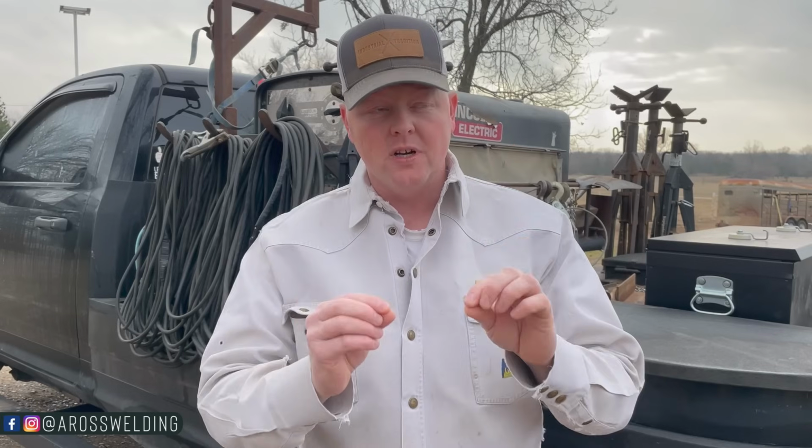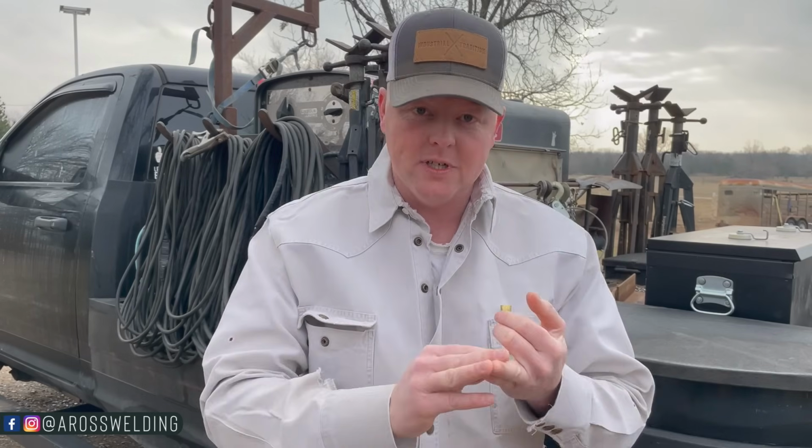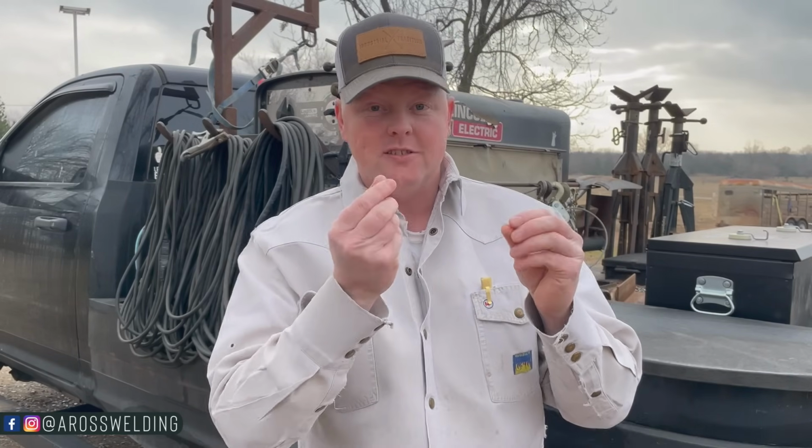But I got as far as like the 6-inch branch, but on the 2-inch welds and the 8-inch welds, they just x-rayed those. I don't believe they pulled straps, if I remember right. And everything with my 2-inch and my 8-inch was good, except for one of my 2-inch had some porosity in the start on the bottom. So that's where I remember getting some weld shot. I couldn't remember for the life of me whenever I was making this weld, but that is where, and that's why I'm remembering how big a deal it is to make sure your starts are clean with 7018.